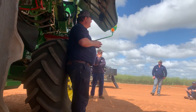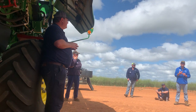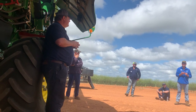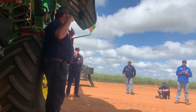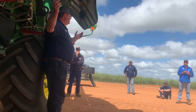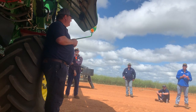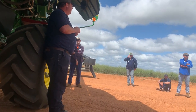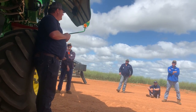But so you're saying this feed accelerator, but there was a massive difference just in those fronts. So. Yeah. If your crops here are good enough, if your feed accelerator are dealing with it as it is, that's fine. I'm just saying there is a solution for it if you do get into a thicker crop and you're burning belts every 5 seconds. Yep.